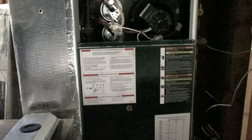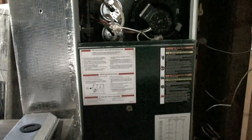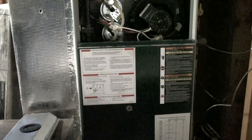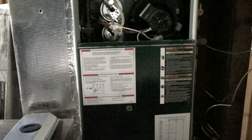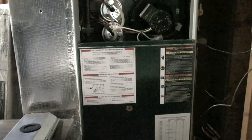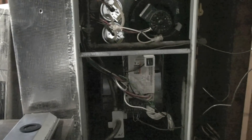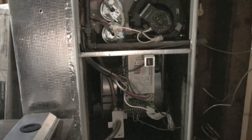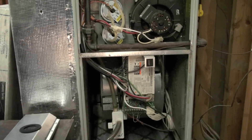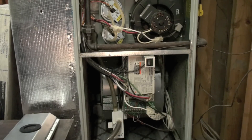If I pull that bottom cover off before I look for the code, it kills the power from the door switch and I will lose the codes. So it's important not to pull that panel off if you have a failure — look through there, see what the code reads, and record it. In this case it is marked on the IFC control. You can see the IFC centrally located under the bottom panel; it has diagnostic codes listed on it that tell you why the furnace shut off. You can recycle this furnace by turning the power off and then turning it back on again and it will attempt to relight.